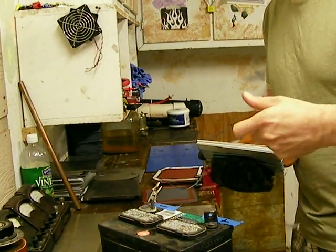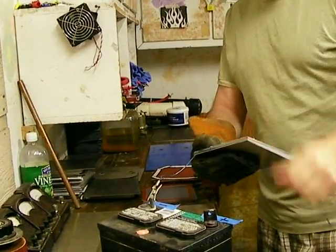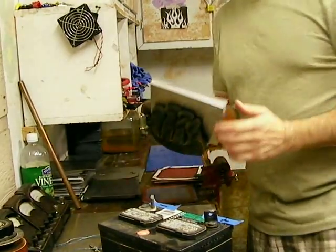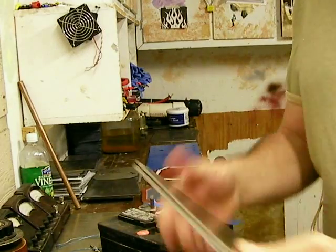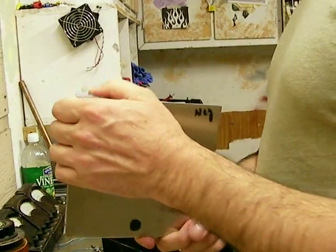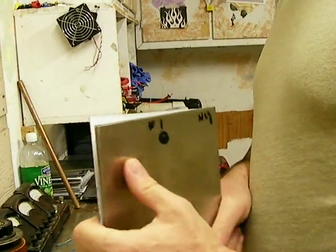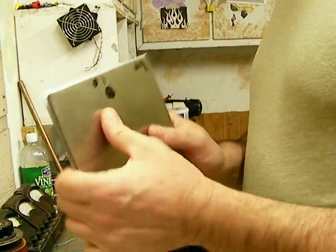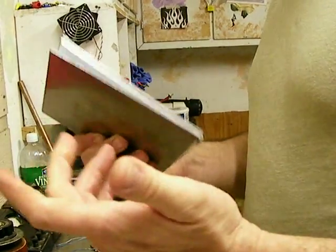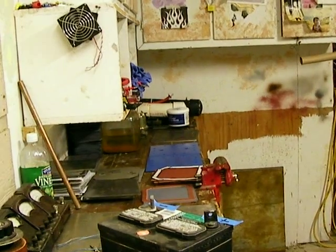Be careful because this wire gets really hot — just from those little taps. The wire gets real slinky and limp after that. There you go — I've just magnetically aligned these plates. Another way to do it is to put an automotive light bulb in series with the wire and let it run for about a minute or two. But this method works pretty good. That's how you magnetically align plates for your dry cell. Wasn't very hard to do. Advanced Hydrogen — you guys have a good day.